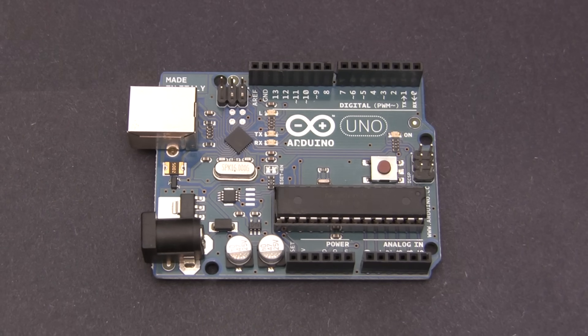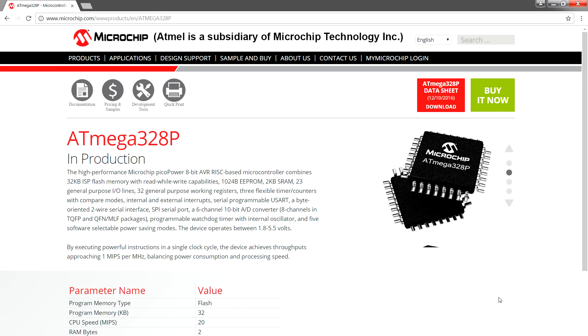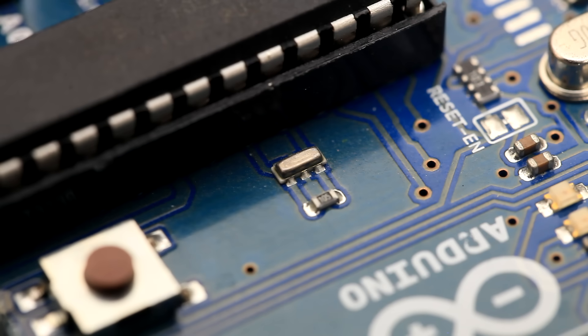So you've got your Arduino Uno. The first thing I want to do is get you familiar with the hardware. You'll often hear Arduinos being called microcontrollers, and that's technically incorrect. Arduinos are circuit boards that have microcontroller chips on them, but they also have a lot of other stuff on there too. This is the microcontroller. Arduinos use a series of microcontrollers called Atmega AVRs, made by a company called Atmel. You can buy just the bare chips on their own for about a dollar, but then you'd have to do a lot of soldering. Connected to the microcontroller is a crystal resonator, which controls how fast the microcontroller is running.